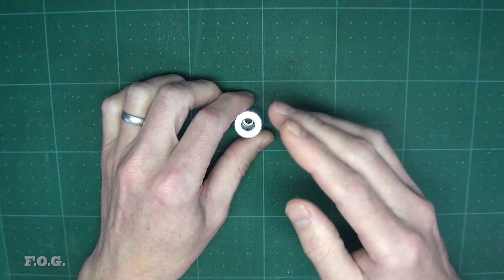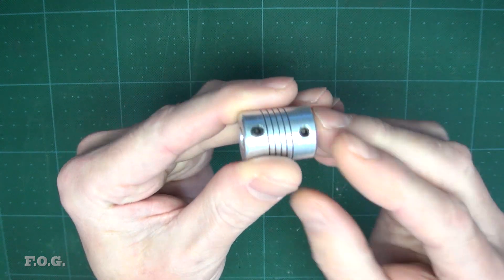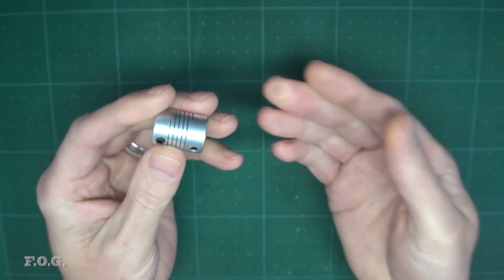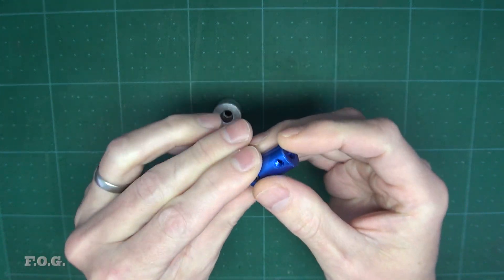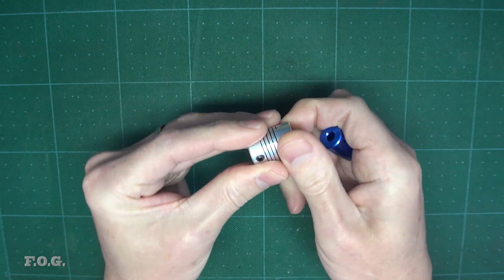Probably the last important thing to point out was that during the assembly you saw me using the spring-type lead screw couplers, and you saw me sort of shifting them around a bit — I was a little bit worried about that. For now, I've just switched back to using the original solid blue couplers that came with the original cheap CNC-3018. I reckon they probably performed a bit better than having all that loosey-goosey springiness in the system.